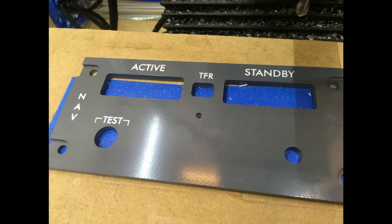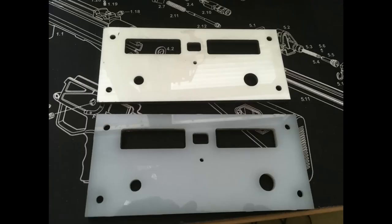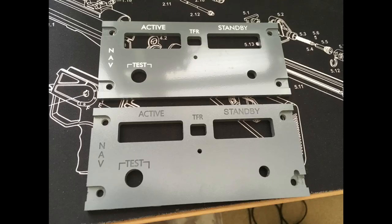I was worried it wouldn't look good because I had done this before with a piece of acrylic that was white but not fully opaque — only about 40 or 50 percent opaque. Here's the backside of both panels: the one on the bottom, done earlier, is white but not as opaque as the one in this video. If you flip them over to the painted side with the engraving, you can see a huge difference — the top one very obviously pops out while the lettering on the bottom doesn't look right at all. So the type of acrylic you get is really important for this.